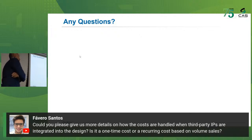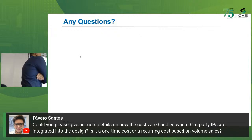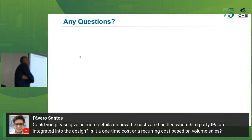But how many analog designers you need on a chip depends on the chip. There are chips which are heavily analog, where you have a small digital block surrounded by a large analog island. We do many of these actually. And you have the opposite: 90% is digital, and you have just a PLL for analog. So it's impossible to give an average, because it would be an average with a very big variance, so it doesn't have much meaning.